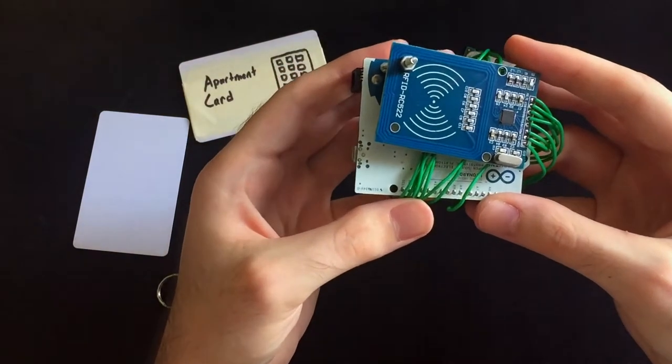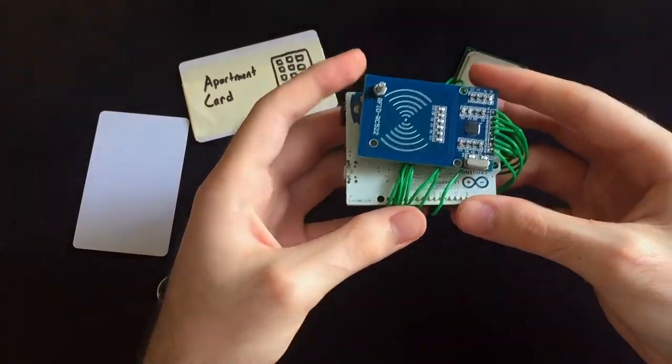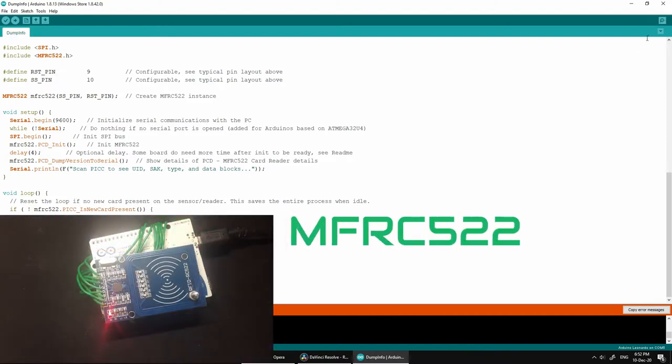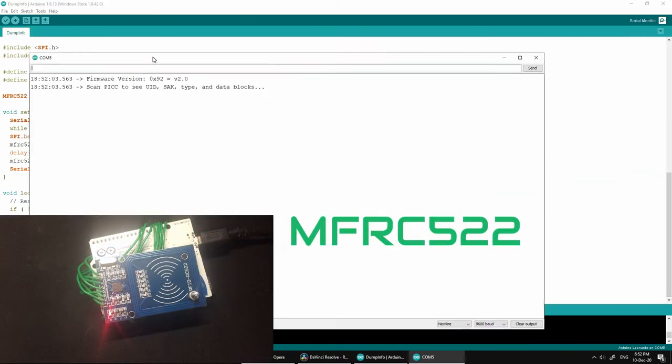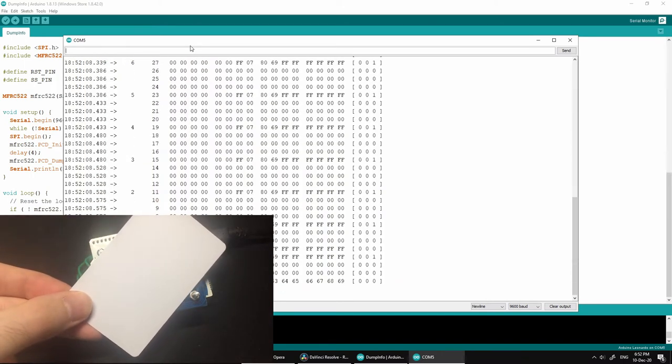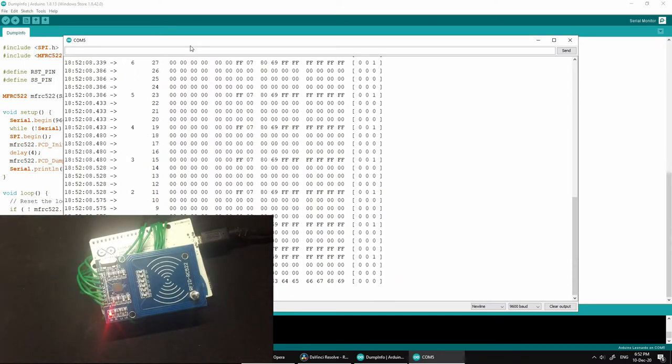Now let's look at how it reads the RFID chips. As you can see, I have an example sketch opened right here. This example is from the MFRC522 library, which you can find the link to in the description down below. As the name suggests, this DumpInfo script dumps info from our RFID chip. It is already uploaded to my Arduino, so let's look at how it works.